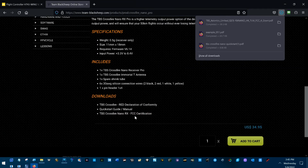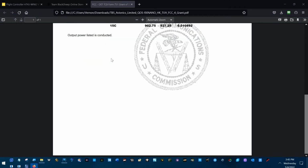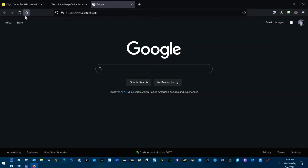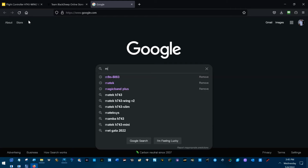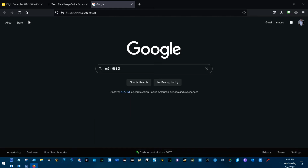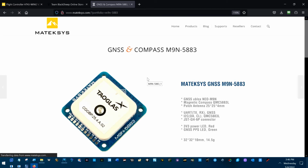This should be up to date, but I don't think it will be either. So we don't know. My thoughts are, if this thing puts out 500 milliwatts of transmit power for telemetry, there's some overhead for the rest of the circuitry. It draws 510 milliwatts. Or 520 or 505. I don't know. We just looked for specifications and didn't find it.